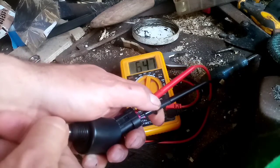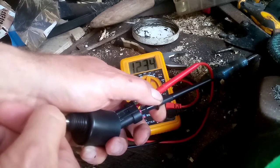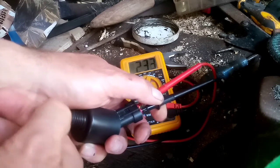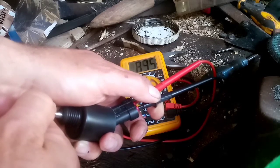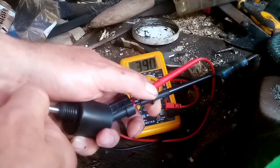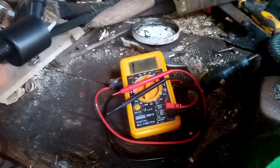It's a little bit jerky on this shaft, and then suddenly it's all over the place. It's coming down to 700 and then it jumps all over the place, and then it goes nice again. But look, it's jumping up to 1900 and then back to normal. So we can safely say that is confusing the combine massively.